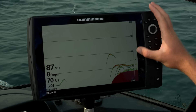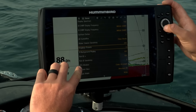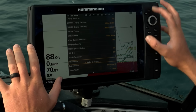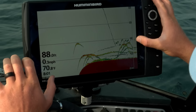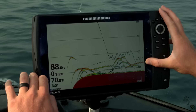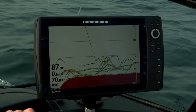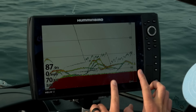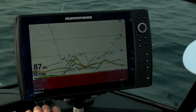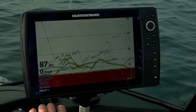Something else that's really crucial is getting this A-scope color frame over here. To do that, you go into menu, menu, and go into your sonar tab, then work your way down to the RTS window. When it's off, you can't see anything, but I really like the color A-scope because it allows you to see this real-time column. Like right now, we can pick out James jigging right here. Those fish didn't quite like that — here he goes down chasing him. Now he's right on him again. This window on the right is the real-time view. We're watching this first section of the screen to see the most recent information that's happening, which tells us if we need to go up or down with our jig, or if we need to slow down or change cadence.